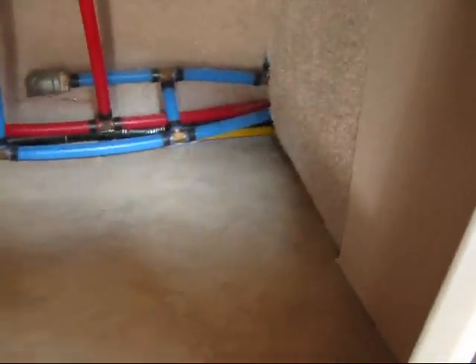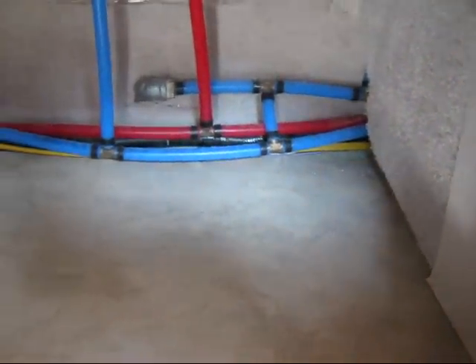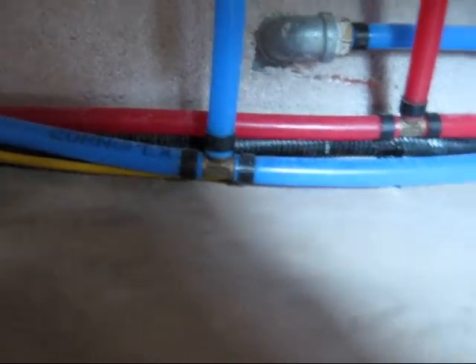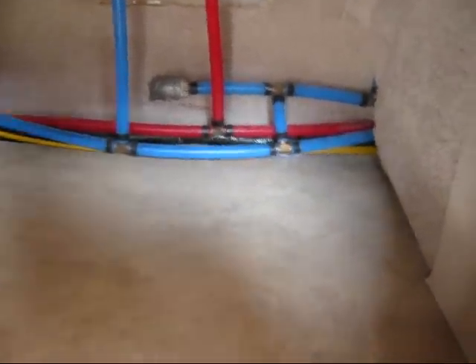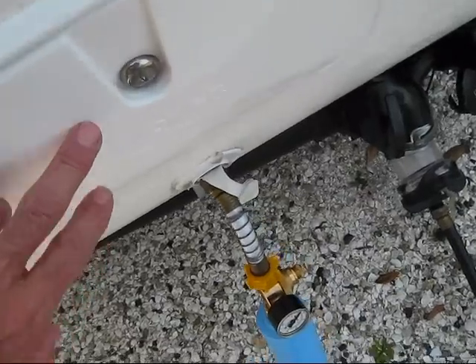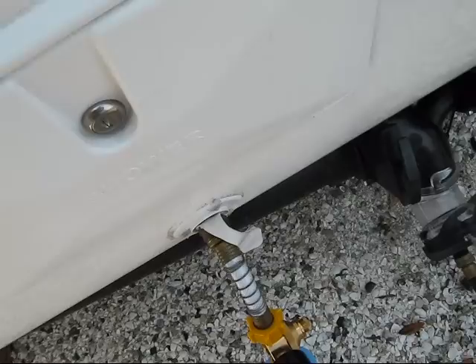When you energize your system with water pressure, it's a very good idea to run around and look for leaks in any of these PEX fittings. These fittings are crimped on — you need a special tool. PEX is used in the marine industry a lot. It's worth checking for leaks, especially in this front connection area here. One last thing to remember: if you have a shower, make sure you open this up and bleed this out too — it's going to probably have an air bubble in there.